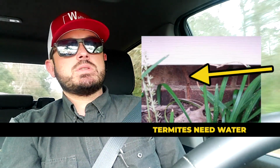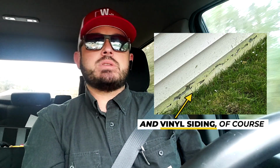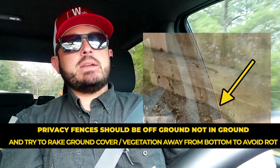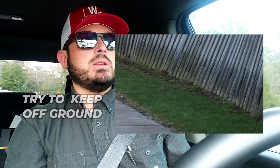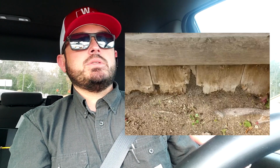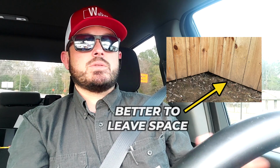And then another thing is, whoever is handling your yard, especially if you have an EIFS stucco, wood siding or Hardie, make sure that they're not weed eating so close to the house that they're damaging boards. That too applies to privacy fencing, because over time that continuous cutting up against the privacy fence damages the wood, and then it'll be 1 inch, 2 inches, 3 inches of the boards will eventually just rot.